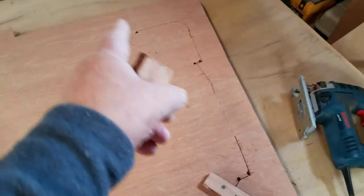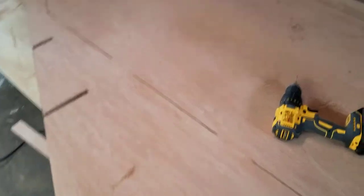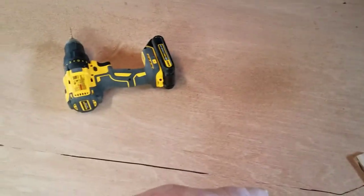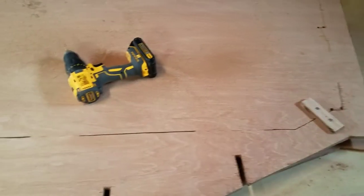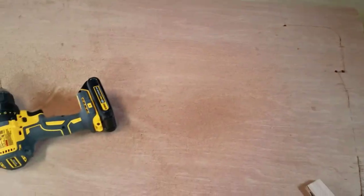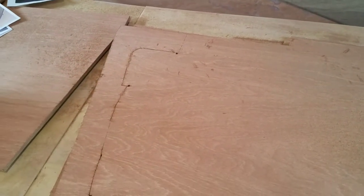Then I have these inside lines. The bulkhead is going to be with the point up so I can put the shell on the bulkhead. But when the whole shell of the boat is done, we're going to flip the bulkhead over, and this inside area where I cut slightly — that is going to be the inside of the boat that I walk through, and this is going to be the floor. That needs to be completely cut out once the boat is flipped over, but for right now it needs to stay there because it's going to be holding the boat up. I got these inside lines on the plans, and you can see where it starts — there's a line, then I cut some of it, and you can see how the line goes all the way down and across and all the way up to the top. Eventually everywhere where that penciled line and the cut line is will be completely cut out, but for right now we want it to be strong.